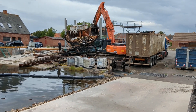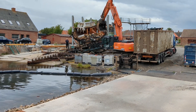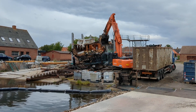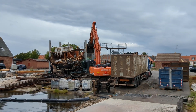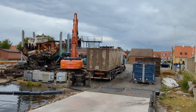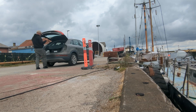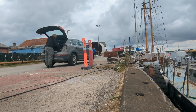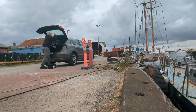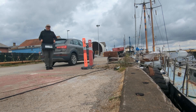Oddly enough though, I actually had the engine started the evening before the move. The engine didn't start on the first couple of attempts, even though I could clearly hear the starter motor engaging, but after pouring a bit of juice into the battery from shore power, I managed to get Ophelia's oily beating heart up and running. When the engine started though, I did notice that the charge on the battery, as indicated by the battery's voltage, dropped quite a bit more than I'd expect from just that one start — from just over 13 volts to around 11.8. As this was the first time I had the engine started after Ophelia's winter slumber, I let it run for half an hour or so, during which time it ran perfectly. I then shut it down and connected the battery to an external charger instead of the engine, so that it would be ready for the day after.